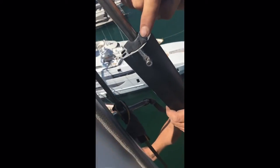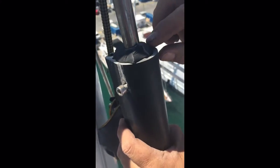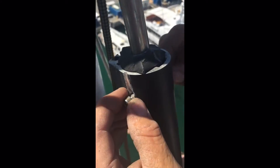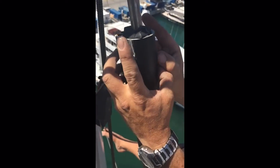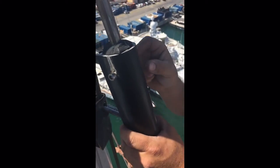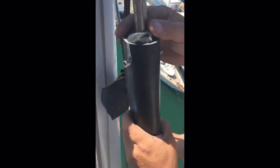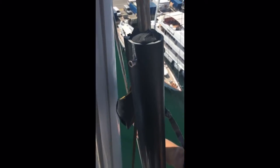So here we've got some evident damage. What's happened here is the swivel that we were checking out on the other one has been hoisted up too wide. Normally this would be a top hat. You can see where the plastic is all cracked. These fastener screws hold that in inside here and then it sticks up and out a little bit. That's been broken off. These screws have been dragged out and what's left is clearly a repair. That's something that should be replaced — it's there for a reason to stop the swivel coming off the top of the foil.